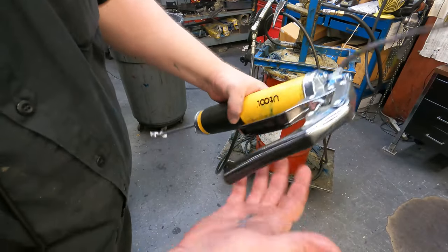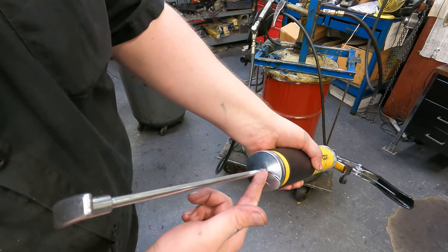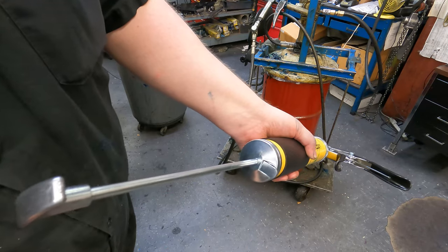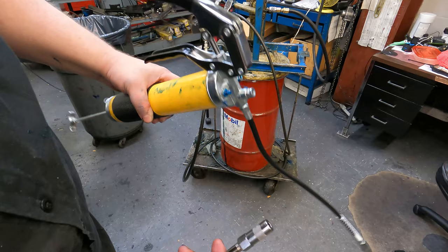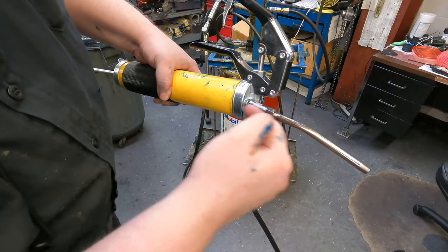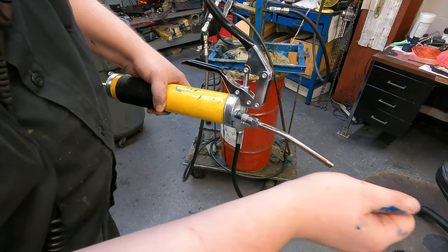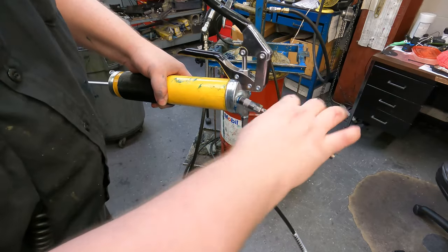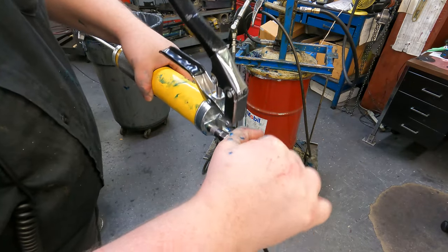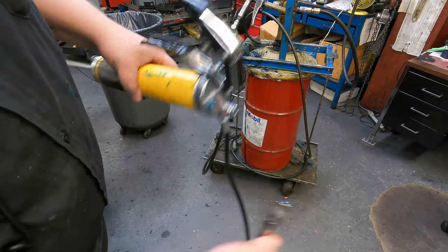Sometimes you'll find you're pumping along but nothing's happening. When that happens, sometimes it's because this lever can stick up — this is always going to be trying to push down, but it might jam and hold there so you're not pushing into grease. If that happens, just press the handle to start working again. Now, something people should be aware of: the way Zerks are supposed to work is you pop this thing on at 8,000 pounds of pressure. If it could easily pop off, you'd never get grease inside. The way you take these off — you don't pull straight. You pull to the side, you bend it, and it always pops right off. If you try to pull up, you're going to struggle. All you've got to do is bend it to the side and it comes right off — tight and easy.